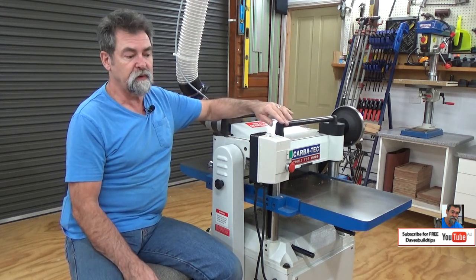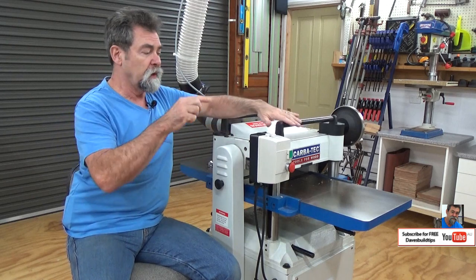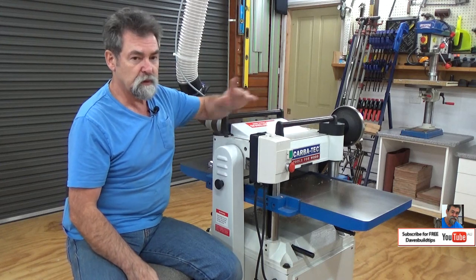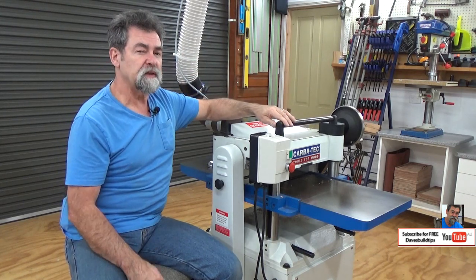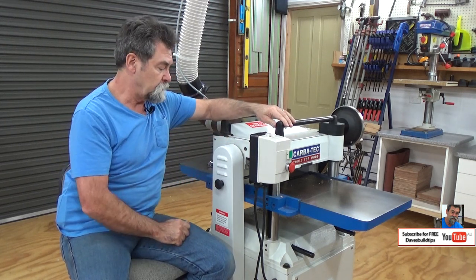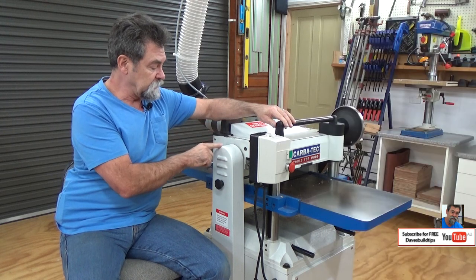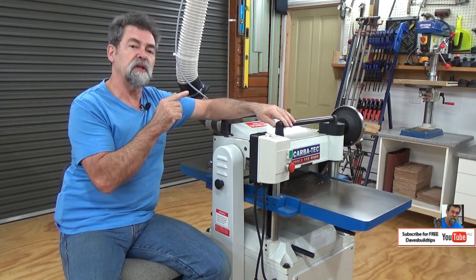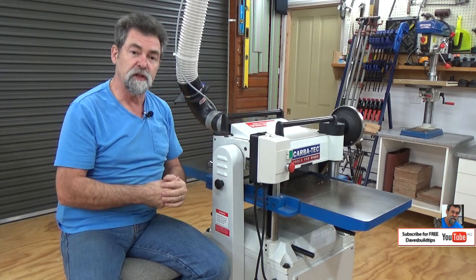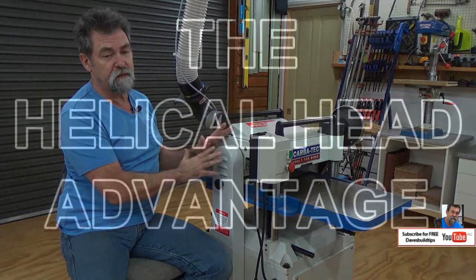Allow yourself a couple of hours, maybe three if you're going to take your time. Also clean off the greasy protective film on the tables — that's just to stop rust during overseas shipping, as these are all imported to Australia. When I first ran it, I was getting some black powder around the casing that holds all the drive belts from the motor up to the cutting head. You can adjust the tension on the belts — there's a swing arm in the cabinet that supports the motor, very easy to adjust. I loosened it off slightly and it goes beautifully.